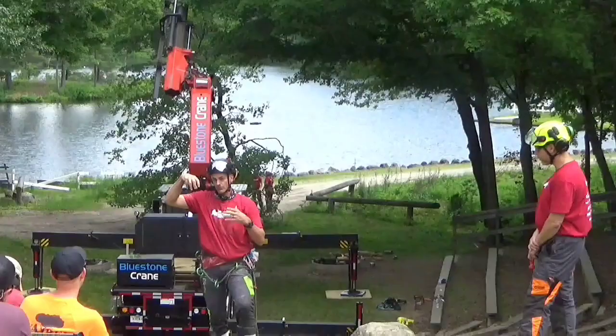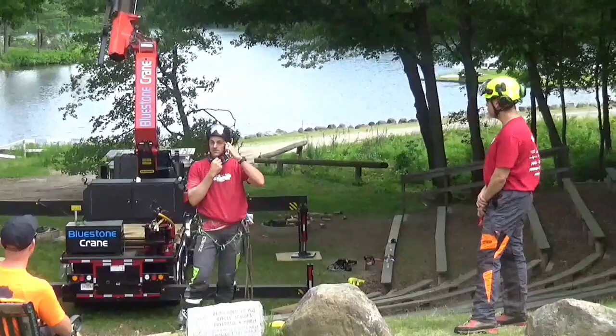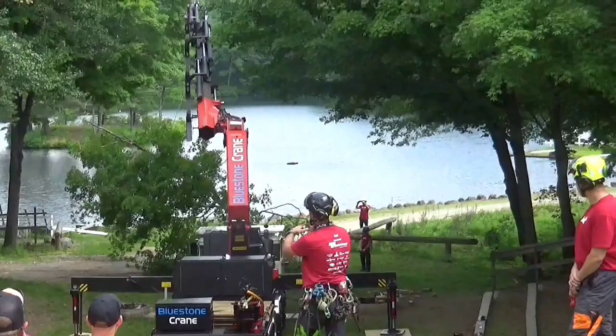I make my cuts, make sure they're all the way through, get out of the way, and then he lifts. If it starts to tip, it goes slower and he can control that tipping motion a lot more smoothly. It really buys us a lot of time using cuts like that. That's not the only cut to use — straight cuts work fine, back-to-back cuts — different shapes and varieties of cuts are really important to keep in your toolbox. But that's an easy way to control something like that and make sure it doesn't move away too quick.